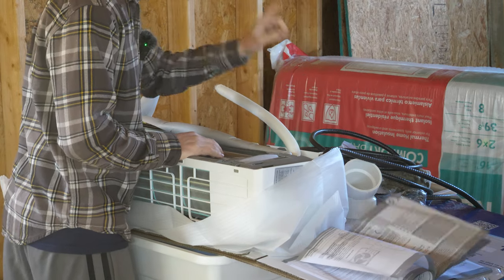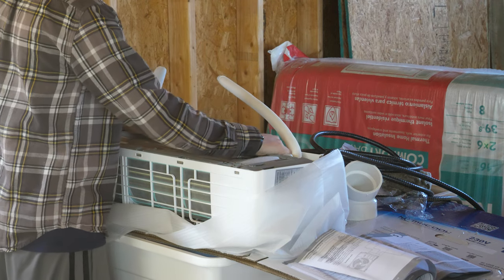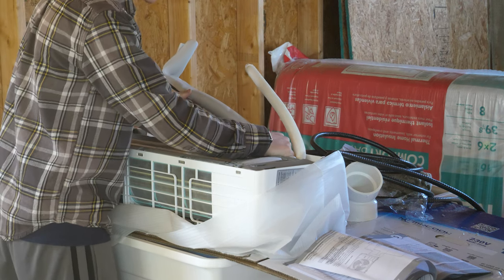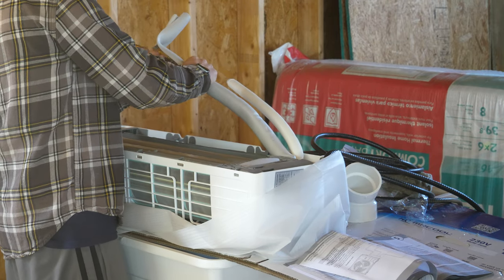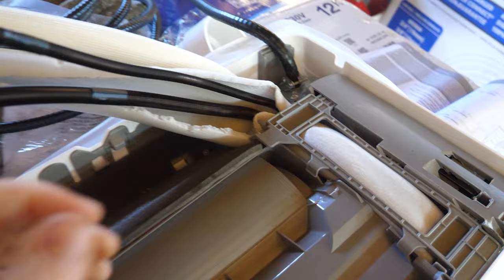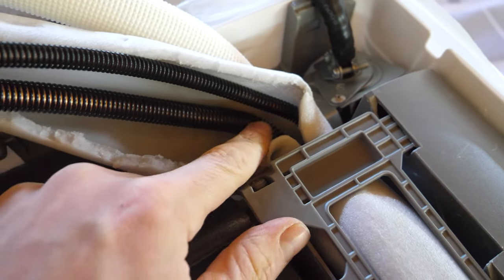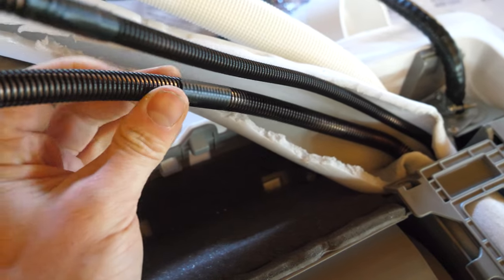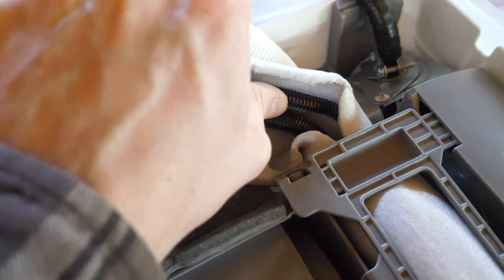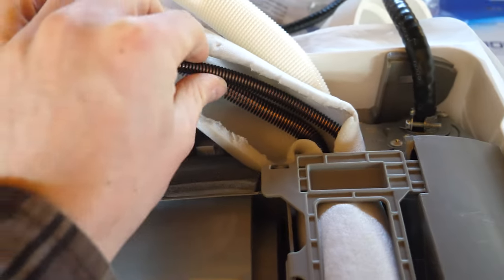We got our MC cable, drain pipe, and refrigerant pipes going through the hole — we're supposed to very carefully bend the refrigerant pipes outward starting with your hand at the base. In bending these copper line sets I wanted to make sure they didn't kink at the base, so I cut the insulation back a little bit. The bending springs included prevent the copper from kinking. I bend copper a little bit at a time in multiple places rather than all at one spot.